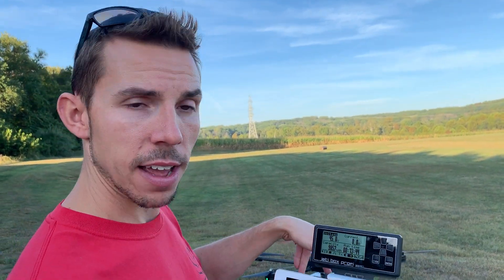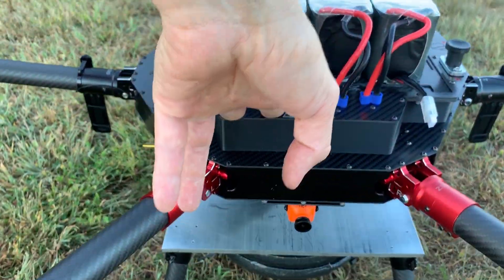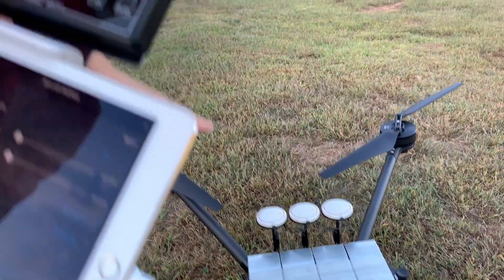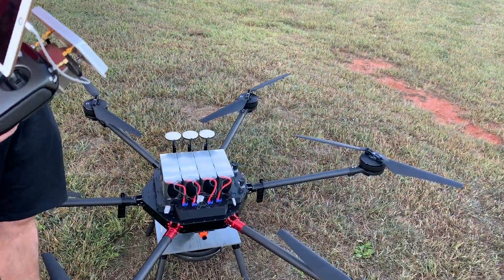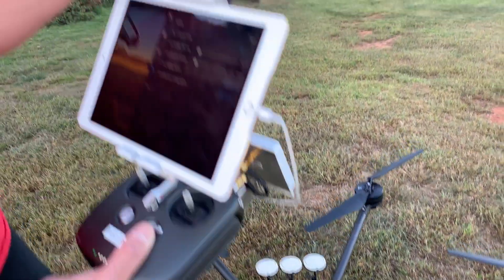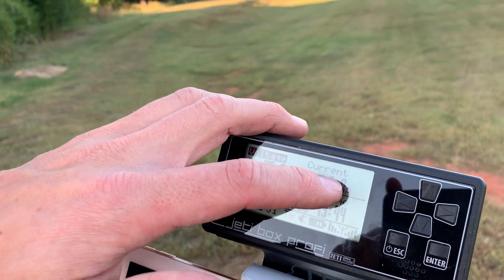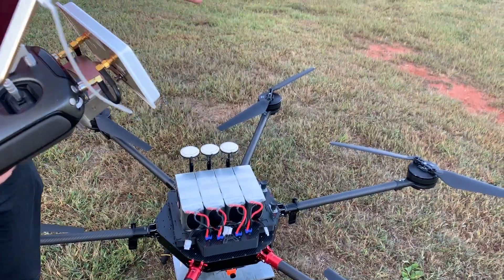The current sensor is on these two rails right here — we are not sensing these other two batteries. This is a 12S two-piece setup. That means in the air, this capacity reading is real time because we're reading just these two packs. If you're ever doing measurements of any sort, the whole system is actually using twice the current shown here — current from both sets of packs. We're monitoring just these two packs to keep it simple and for redundancy.